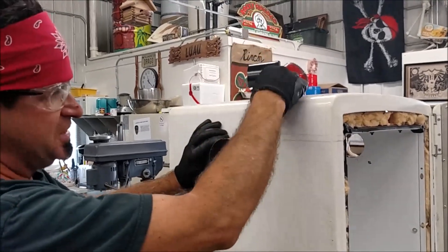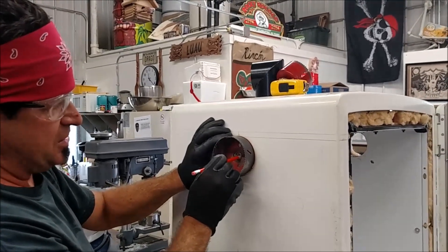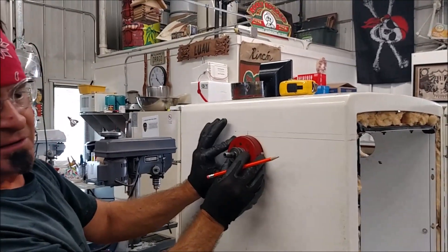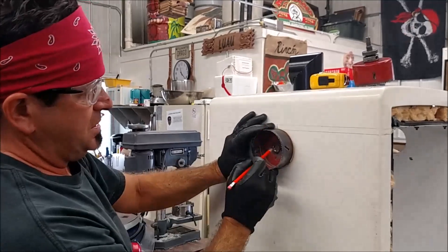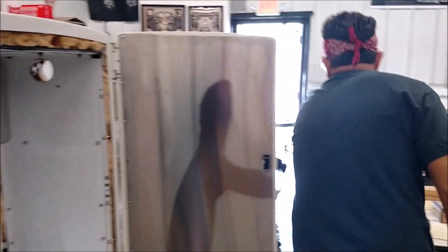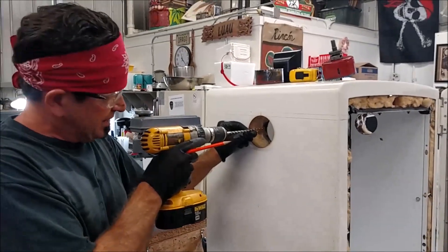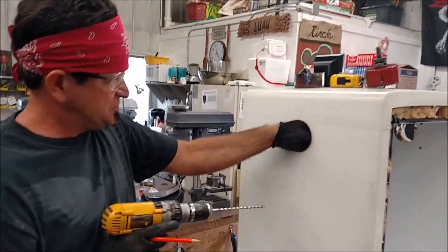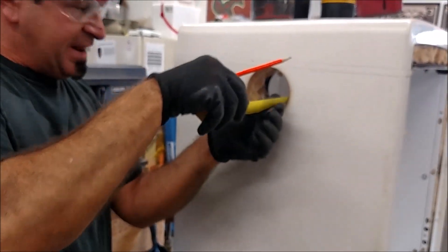That way you're not drilling up into this cavity that's insulated. This is where your drill bit is going to go through — I marked this as my center. When I set up my hole saw to drill, it's going to go right through. What we did ahead of time was mark our center, then took a drill with a very long drill bit, pre-drilled the pilot hole, and kept the drill level going all the way through. So you have two holes because, as you can see in here, there's a cavity.